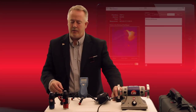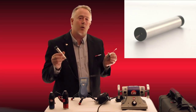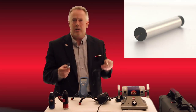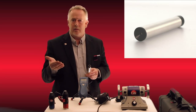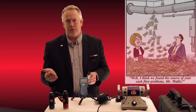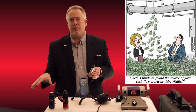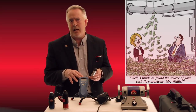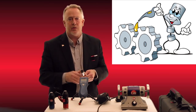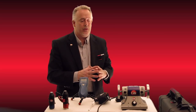Moving on to ultrasound, we're able to take ultrasound measurements within the plant. This is not a wireless sensor in our lineup but it is tethered to the iPad and has its own application to work seamlessly with the vibration, thermography, and everything we've built. Ultrasound is most useful in the plant and in predictive programs for leak detection throughout the plant, whether it be compressed air lines or vacuum — any leak of any type, ultrasound picks up very well. That app also works seamlessly with ViPro, and it can also be used for grease and lubrication programs, so knowing when to grease and not to over-lubricate motors during a lubrication session.